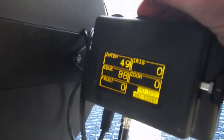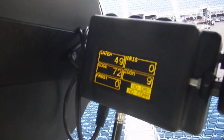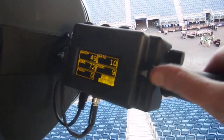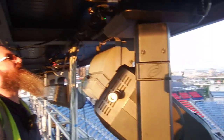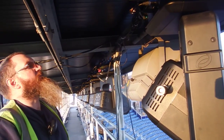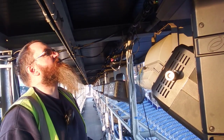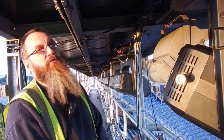That's working, that's working, that's working, that's working, and the thumb slider's working. It says no DMX at the moment because it's initialising — so it's just unlocking. And it's going through self-test up here. Once it's fully initialised, the LCD display will show any error codes and any encoders that have worked or not worked.